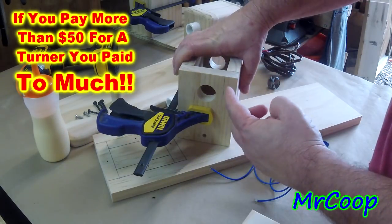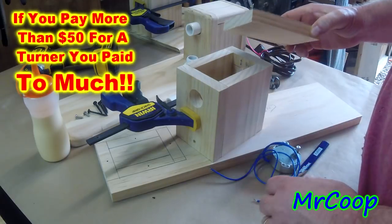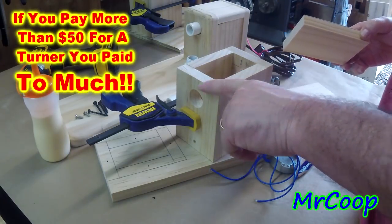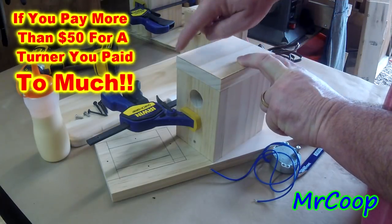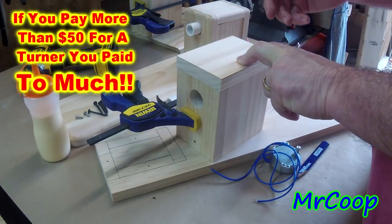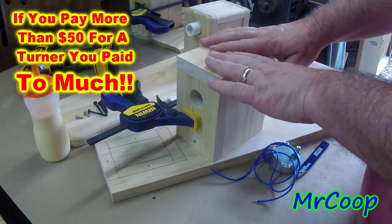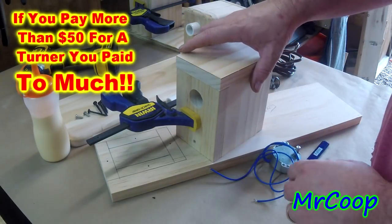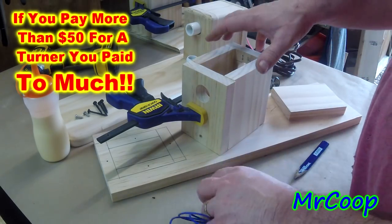I have a nail gun so I use a nail gun to nail mine — you can use regular nails. Once you have it all glued and put together and everything's squared up, pop a couple of nails in each side and it's done. Then glue the top, set it on top, and hit it with your nail gun. Or you can drive screws, but if you drive screws, make sure you pre-drill. Once all that's done, you'll want to mount your motor.